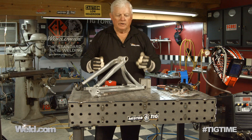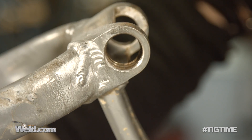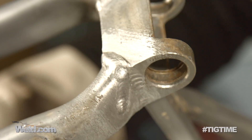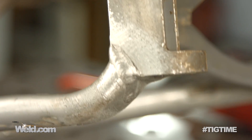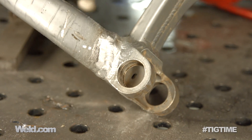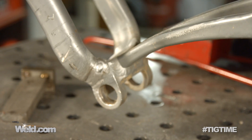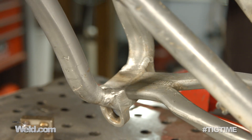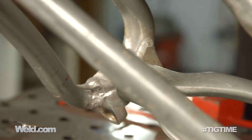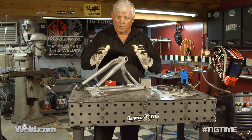I've concluded the welding on here and it actually welded up very nicely. I got to a couple of spots where it just had some paint or something that boiled out. When that happens, just sit there and dwell a little bit longer, because there's no way to get it out if it's coming from inside. So let it boil out, cool off, wire brush it off, or take a little grinder and get rid of it off the surface, and then resume your weld. Because remember, aluminum does not want to wet out naturally, so it's got to have a clean surface to wet to.